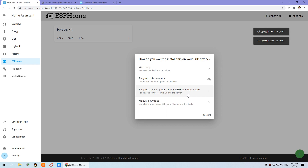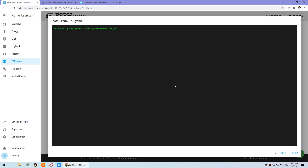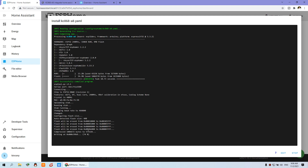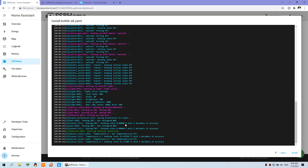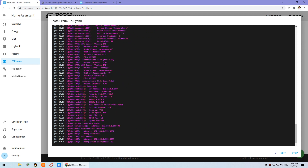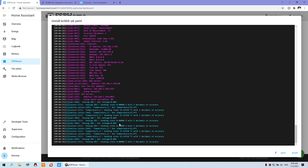For USB via Raspberry Pi, you can click this and detect the USB server port, then click and you will see the files being downloaded. Now the firmware is writing. Writing is complete. This is the log output information. Communication is already successful — you can see this is the IP address for the A8 board, and you can see the temperature data.